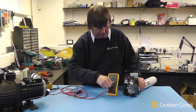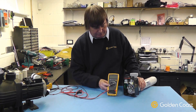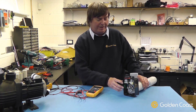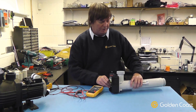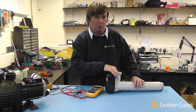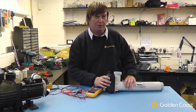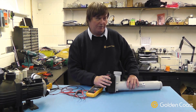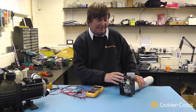It is very important to make sure that the control systems are connected as per the manufacturer's recommendation. If a heater such as this, a plastic body type, was used without the correct flow, and the flow switch not working, this complete body would melt in seconds. So it's very important to make sure the control systems are connected correctly.